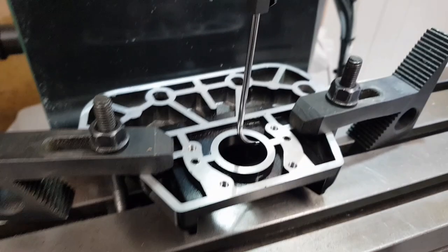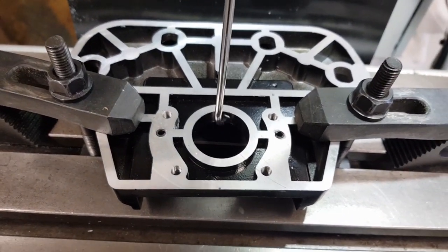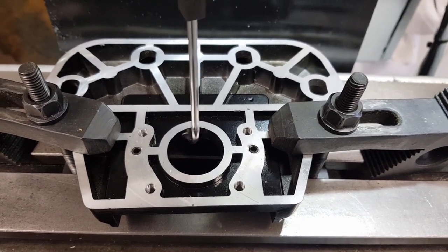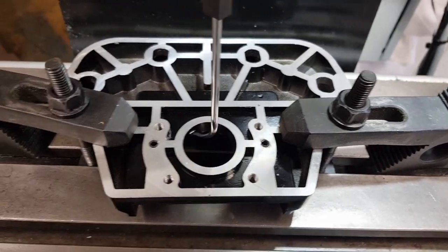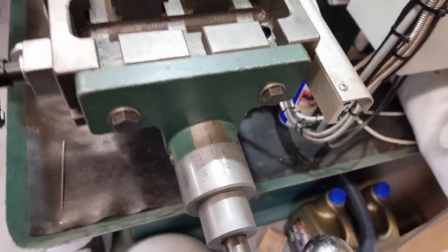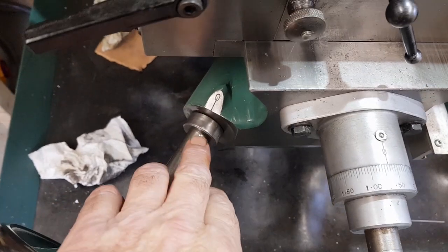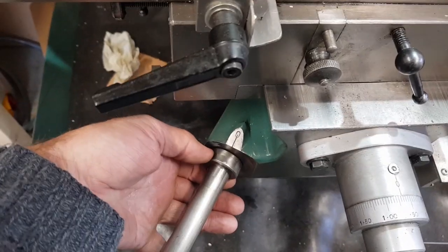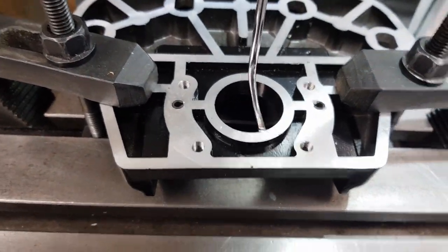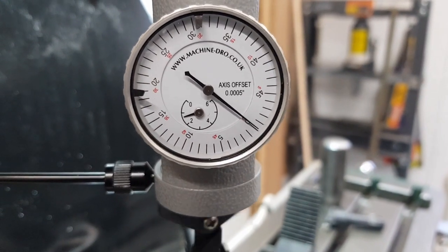Very impressed. That's the back side of the Bridgeport X-axis. I don't know, it's one of them, but off a Bridgeport. And I need to bore it so it'll go over this bush here, which I think it needs about 2 mil out. I'm gonna do some measuring now, but I've got it centered. That's just about perfect, but do we go for even better?